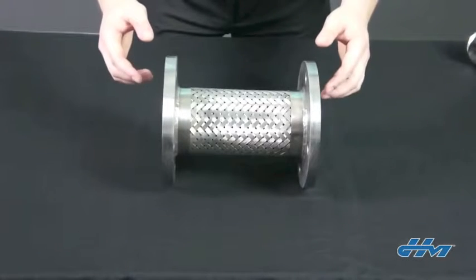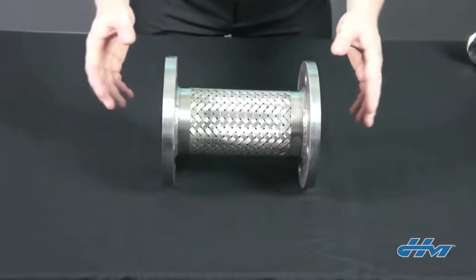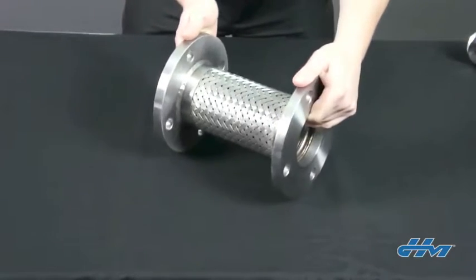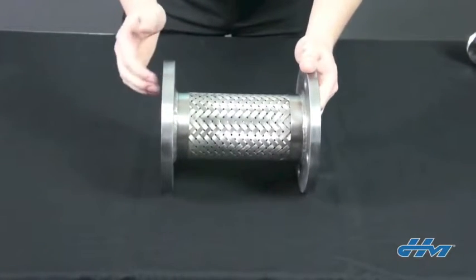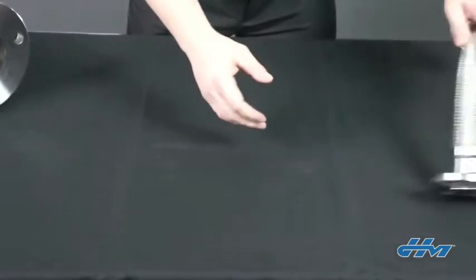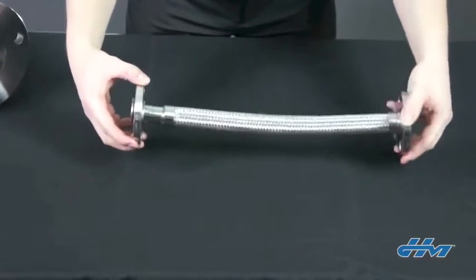Torquing the hose during installation is common and can be an issue. If the existing piping does not have any kind of swivel or rotation, don't use an assembly with fixed end fittings at both ends, otherwise installation can torque the assembly and strain it in service. Do use a swivel, floating flange, or union, or other fitting that allows the hose assembly to twist during installation.